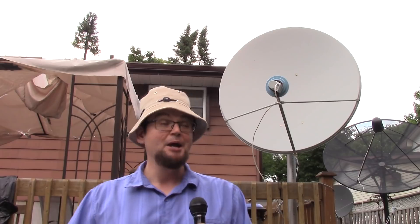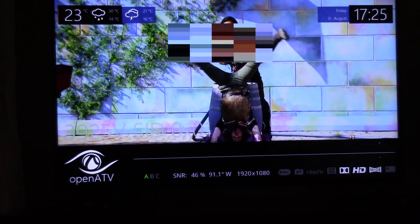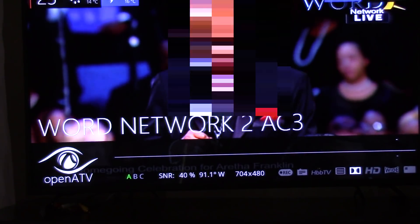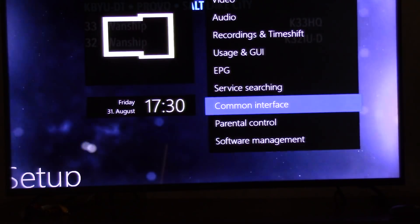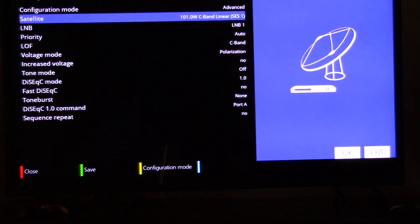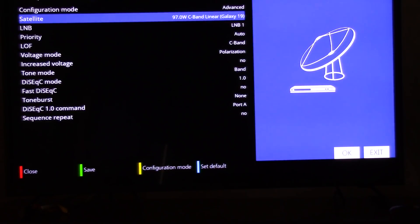There was really bad wind yesterday - I set it up and it was working, then I went inside and it wasn't working anymore. So I aimed it at 91 west. There's a few channels on there including the BYU mux, which has a lot of movies and content, and that channel was coming in really strong. I'm getting about 46% SNR on BYU. Going into the receiver - service searching, tuner configuration - going to LMB4, 91 west C-band.